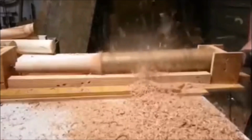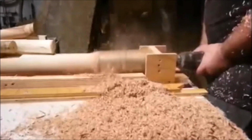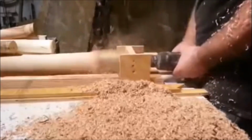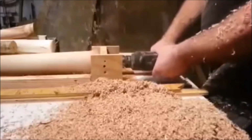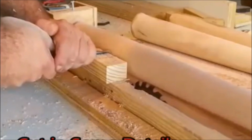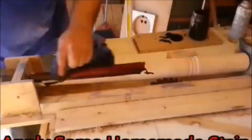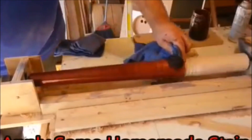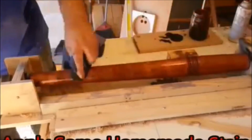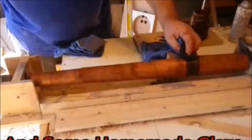Now for the legs, I'm using yellow birch branches as I harvested the year before. They're fairly dry and pretty straight, but I didn't want a rustic look on this entirely, so I made a jig for my table saw, used my drill as a motor to turn these legs round, and then I took a piece of sharp metal and kind of rounded over the edge, and I was able to add a nice little detail. Now I threw some stain on here, and then I used a little bit of homemade glaze I made from boiled down acorn caps to kind of set it off.